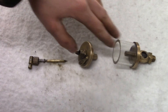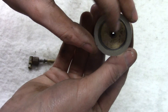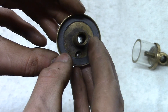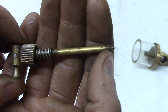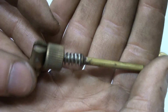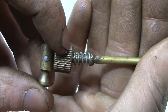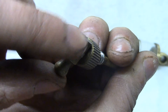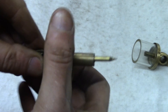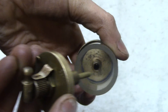Here's the first oiler taken apart. The bottom piece — you can see through there, there's the hole that the needle will seat against. Here's the upper part; no moving parts. There's an upper and lower gasket. Here's the needle valve — you can see the tapered needle, which allows you to meter your flow. The spring is up against this shoulder, there's a little washer which I believe is soldered on, the nut goes over the spring, and what holds it all together is this knob with a pin through it. The needle seats in right against that little through-hole.